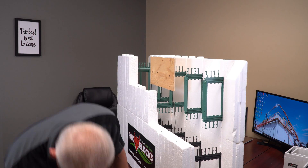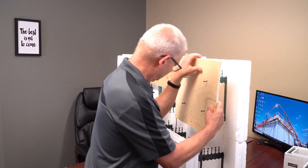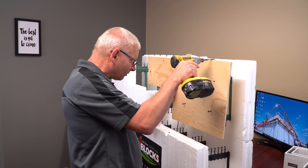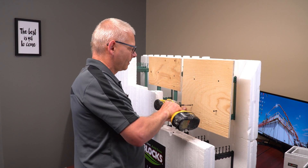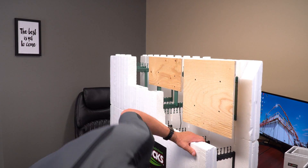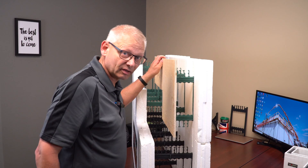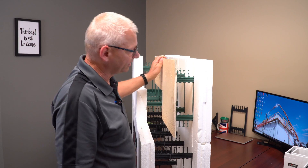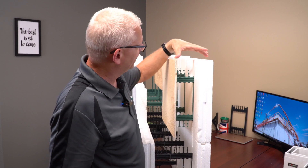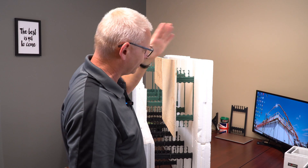Now this 16-inch high one — let's try and put this plywood on. Make it flush with the top of the wall. Typically I'd use half-inch or five-eighths-inch plywood; I just had three-eighths with me. On the eight-inch, I think three-eighths is going to be enough. A lot of guys use OSB — on the job I was just on they used OSB. Here you have a four-inch concrete going up, and with the taper it turns into six-inch concrete, and then you could dress your floor on top of that, put a sill on top of that. In a lot of cases you don't even need the taper, but in this case I did do it.